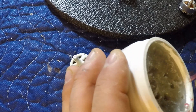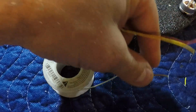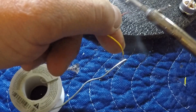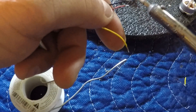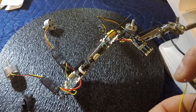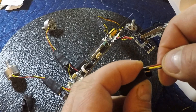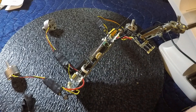We're going to dip them in some flux, get our soldering iron out and some solder. We're going to get a little bit of solder onto the end of the iron — just going to tin the ends of these wires. Always part of prepping is get some solder on those wires. Remember to take that shrink tube, open it up, and run our wires from our motor through it, then put it aside for now.